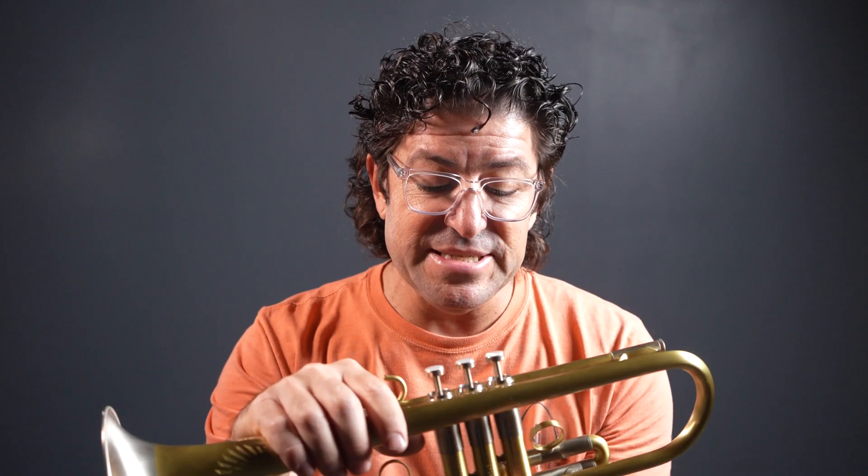Braze is used in multiple places. On a valve cluster, the braces that go in between are brazed in. The liners that go across the ports internally are brazed in. Like on the second piston here, the ports coming out are brazed in.